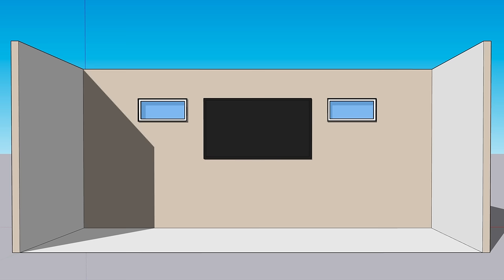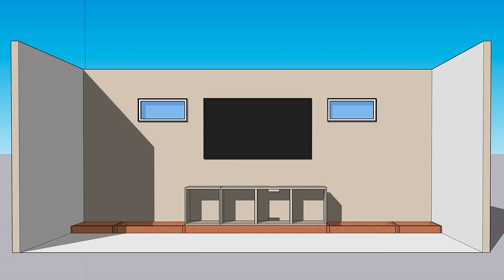I'm building the base in 3 different sections using 2x6s. Then I'm going to put the IKEA BESTA units together for the center of the entertainment center. I'll link the IKEA unit and other tools and products that I used for this project in the description below. After that, I will build the 2 8-foot vertical units out of 3/4 inch plywood. Next, I will build the 2 benches.